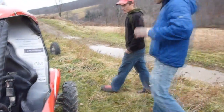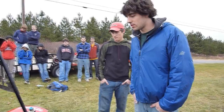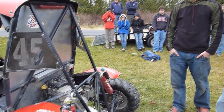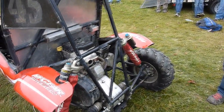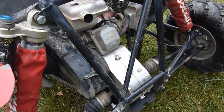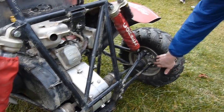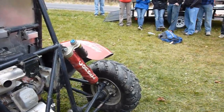As we go back, you'll see our drivetrain. Back here we have a 10 horsepower Briggs & Stratton engine, which is standard for the competition. We use a CVT from a company in Canada, and we custom made a two-speed high-low gearbox. We got all the gears custom cut and you can see the custom aluminum CNC machined casing. We've also been testing with carbon fiber drive shafts. And we custom made all of our rear uprights and rear hubs so we could get nice light rear hubs with outboard brake rotors as well.